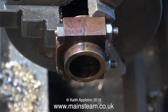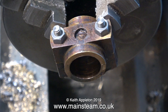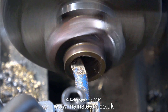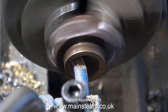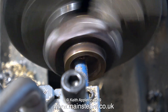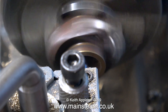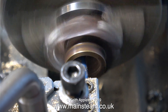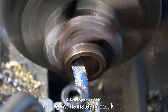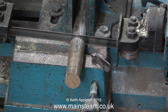Using a soft hammer I tap it into place against the three-jaw chuck. It's not running very truly but don't forget this part has been very hot and is possibly distorted. As long as the square part of the big end brass is square up against the chuck, boring down the centre won't be a problem. In this clip I'm now boring down the centre of the big end brass to remove all the damage - I'm having to take quite a lot of metal away because the grooves are surprisingly deep and it's very badly damaged. Normally when boring a part like this I use the boring tool to cut through, then without altering the setting I reverse the direction so it pulls back the other way, giving a better finish and clearing out the chips.